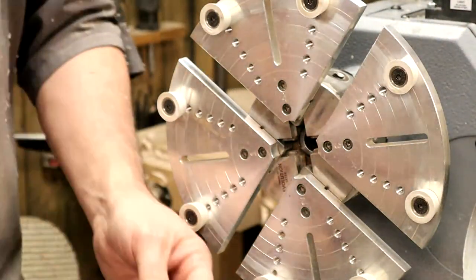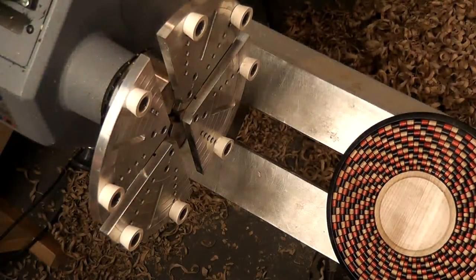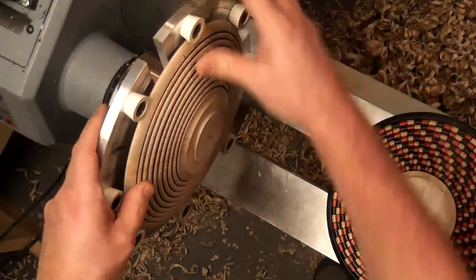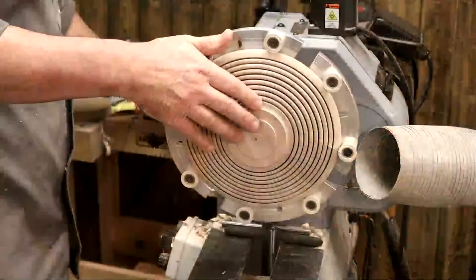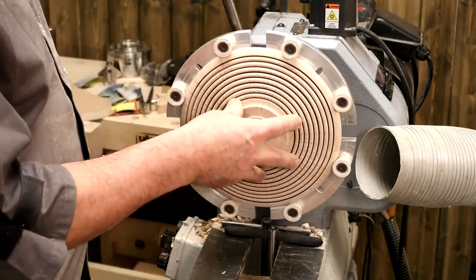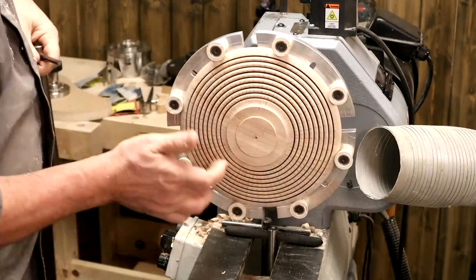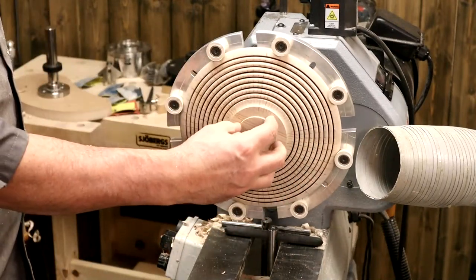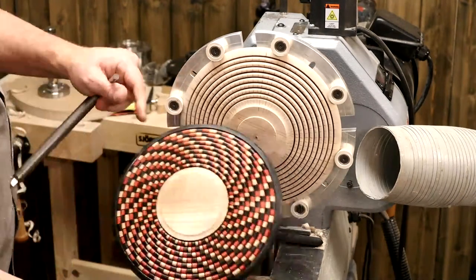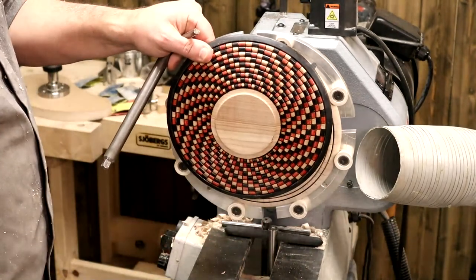If you've got these already, or if you're looking for something to be able to take the back of the bowl away, let's say this is finished. That goes back in the chuck. There we are. And then all we need to do is lock that up. Those lovely little soft rubber buttons support the rim of the bowl, leaving you free then to take out the sacrificial foot. So that will disappear. You can then sand it up. And that's exactly what I've done with this one. That was in there. Clean the bottom up, ready for putting your name on.